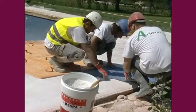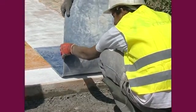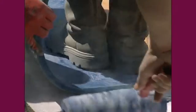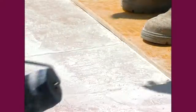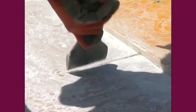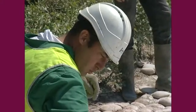At the sides, you use flexible molds, as flexible molds often overlap the framing, and there's more freedom to use these molds for hand application. It's true that with this type of concrete, the finish is fairly important. It's important to make sure the edges are finished properly. That's why you use flexible molds on the edges. I use a tool called a jointer to finish off the joints that haven't been created properly with the molds.